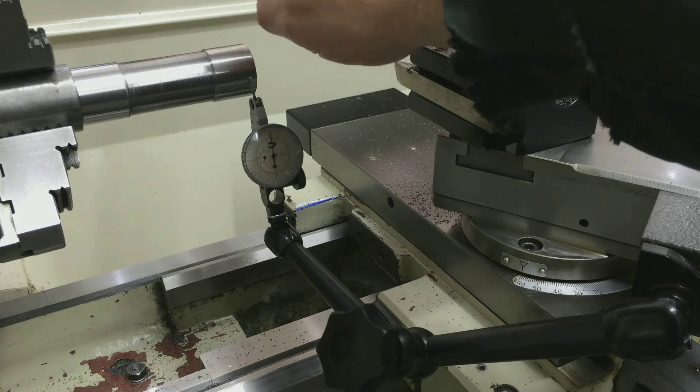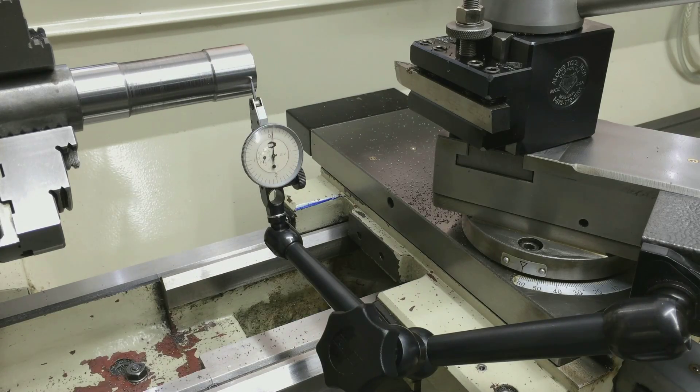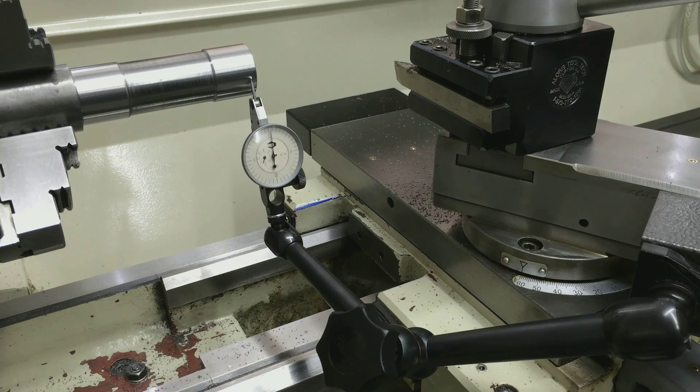As you can see, I can come off zero just by leaning on this thing and get a deflection. So basically I'll set this zero, then go around to that rear adjusting screw and put a little pressure on it with the bolts snug — not loose, snug, and not tight — until I get my one tenth, then make another cut, rinse and repeat.